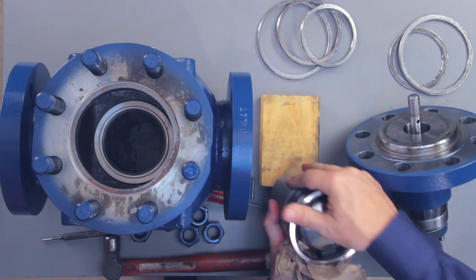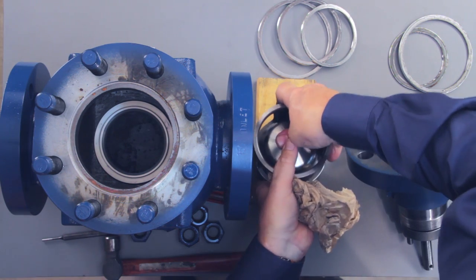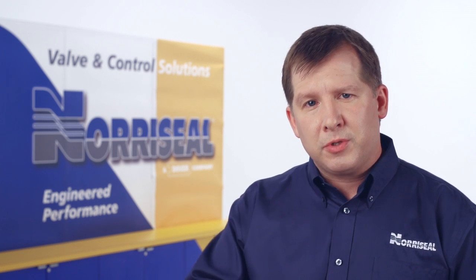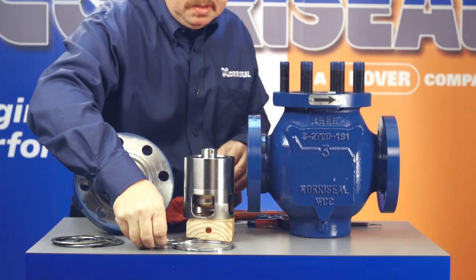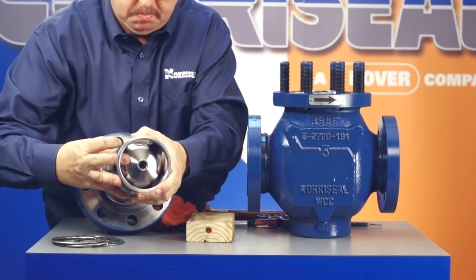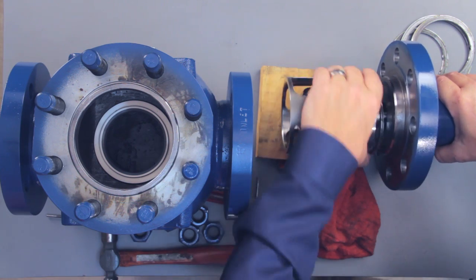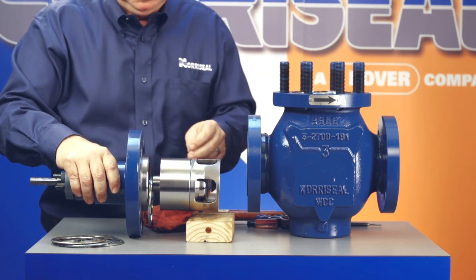To reassemble the guide, cage, and plug assembly, place the upper plug guide upside down on a flat surface and insert the seal rings into the guide recess. Place the cage into the upper plug guide recess with the extended lip down and insert the valve plug with the stem thread down into the cage guide. Press the plug downward into the lower cage through the seals. A block of wood may be necessary to drive the plug downward until the large portion of the valve plug shoulder bottoms on the internal recess of the cage. Next, place the guide gasket over the valve stem to make the seal between the bonnet and upper guide. Install the plug, cage, guide, and gasket assembly on the stem by screwing the plug into the valve stem clockwise until the hole in the plug top aligns with the hole in the valve stem.